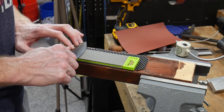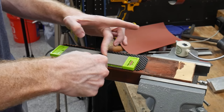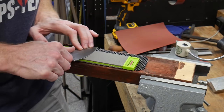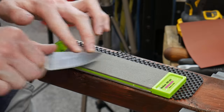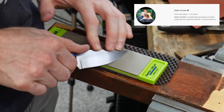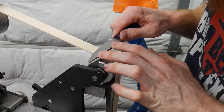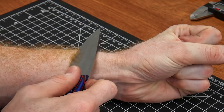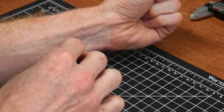Lastly, we're going to be sharpening the knife using a diamond stone. I know there are a ton of different techniques out there when it comes to sharpening knives — let me know your favorite method in the comments. I'm not exactly a sharpening expert, but I can put a good working hair-shaving edge on a knife. I purchased this diamond stone off of a recommendation from fellow knife maker Walter Sorrells, specifically for this video since I wanted to show a low-tech method. After you work the blade on the stone, you'll eventually form a burr, which needs to be removed by stropping — you can strop by hand on a piece of leather, or use a power strop. The diamond stone and strop system worked pretty well and I was able to cut paper and shave hair fairly easily with this knife.